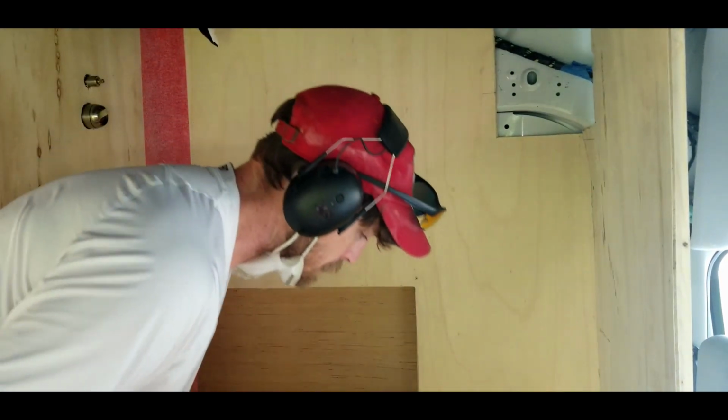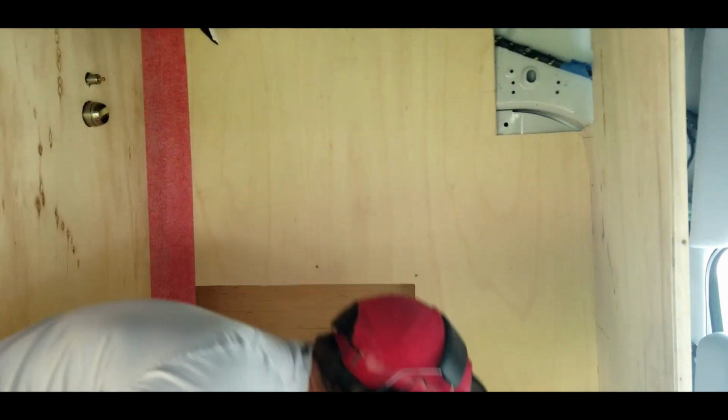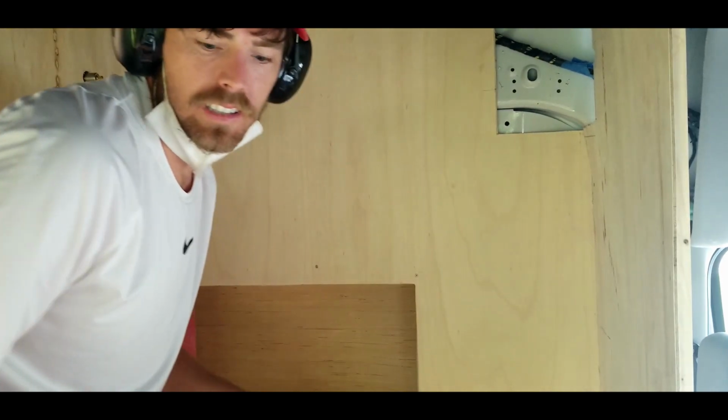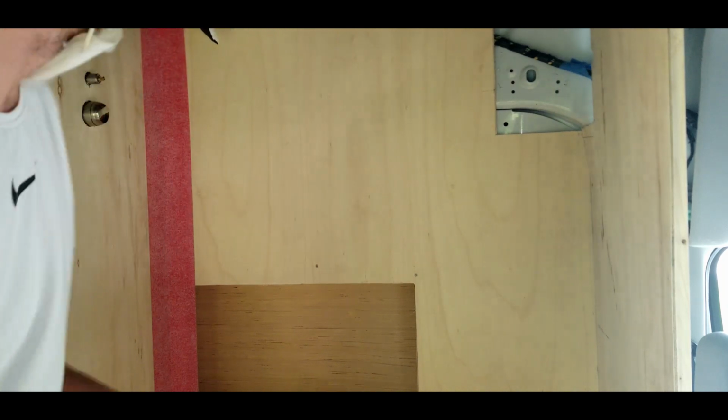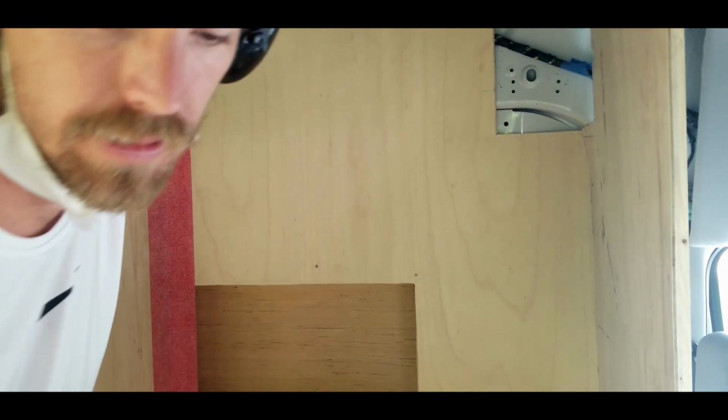Now that I got the walls up, I'm going to use my Red Guard paint on them and the Red Guard corner lining to just make sure everything's locked in and so we don't get any leaks. I'm going to put the plastic on top of this when I'm done too, just to really give it that support.